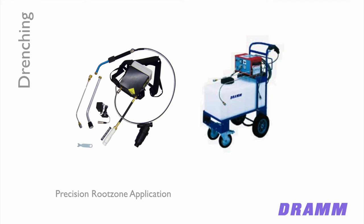Otherwise, you may use tools like our ChemDose machines. The one on the right is a pump-driven version with a 20-gallon tank — a pump cycles on and off based on a button, and you can put the exact dose right into a container. The one on the left is meant to work with either an injector or a hydraulic sprayer and is less dependent on hose length or tank size. There's a meter that will measure the dose and start and stop so you apply that exact same dose every single time, even if the flow rate at the pump or injector changes.